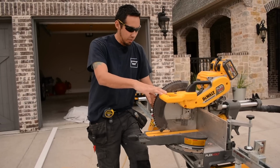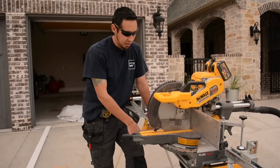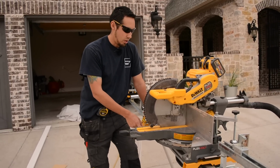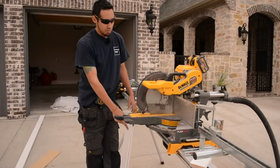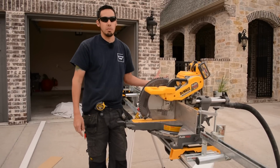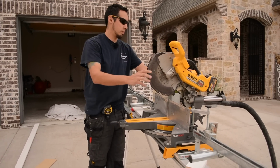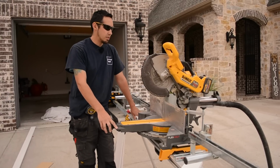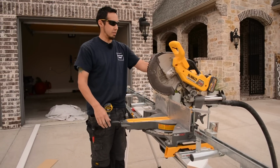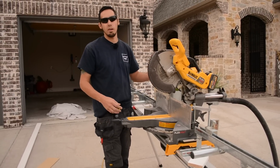And this little extension cord wheel that we have with the 4 outlets on it, it actually has its own little breaker that trips too. So sometimes it would trip that one, and sometimes it would trip the one in the house. But since this is on its own system, it's using the 2 9 amp hour batteries, the 60 volt maxes, there's not going to be that issue with having this and this running at the same time. So they're not pulling power from one another.